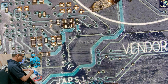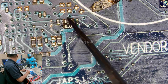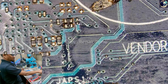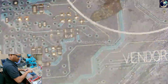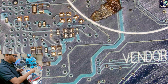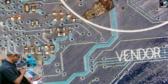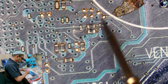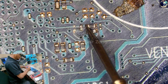We have replaced the capacitor which is connected to this resistor, and the other side of the resistor goes to the power switch. Now I'm going to plug in again and check if the voltage is available at the switch. As you can see, we have 3 volts now, and the other side also shows 3 volts.